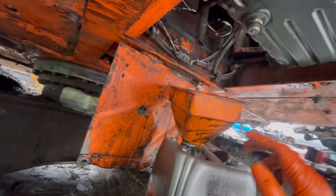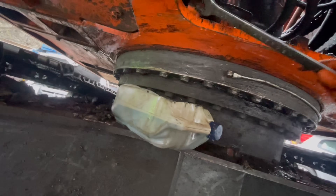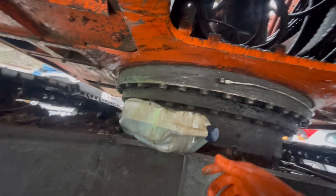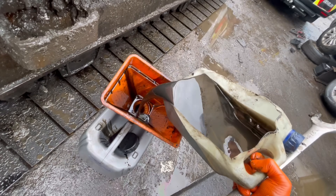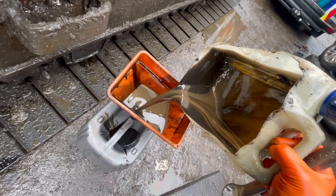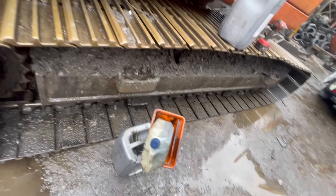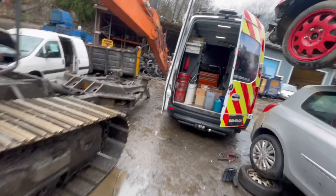You don't generate an awful lot of heat in the slew gearbox unless you service the machine straight after a day's work of spinning around. I'll get this one spun on. The slew gearbox is drained finally. I'll put the bung in now while I'm under it, although it'll be the last oil I put in at the end of the service. There's a little bit of moisture in that oil — it's a little bit creamy. Right, let's see what these fuel filters are like.